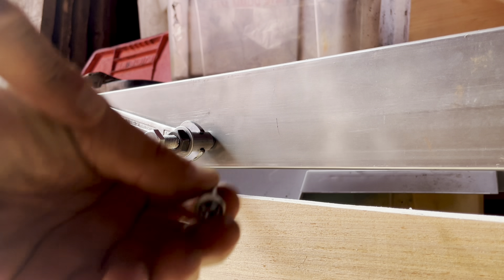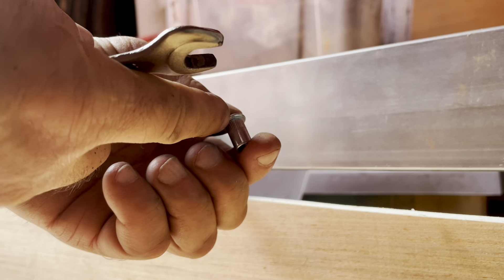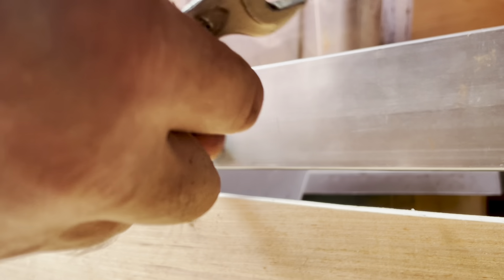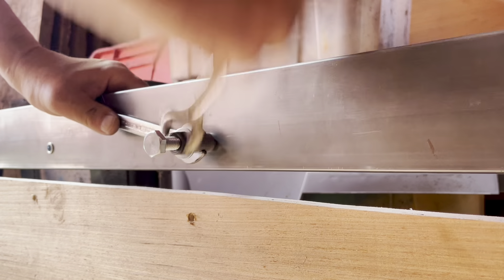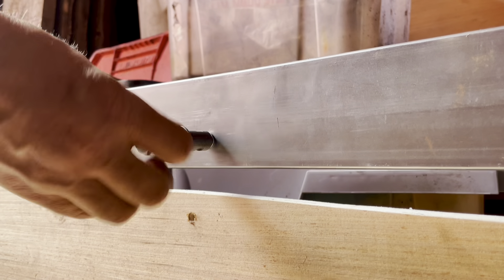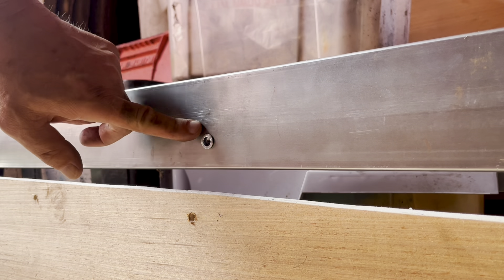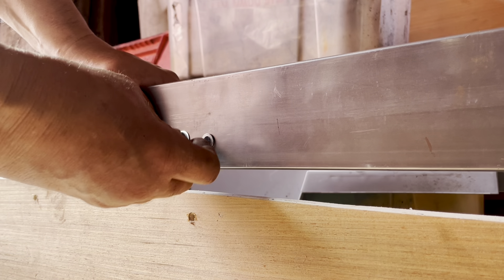You can see it's completely collapsed — this threaded portion has collapsed back onto the collar here, and where it's serrated is gripping on the skin. They're designed to collapse in and grip. So now we've got a thread in a 1.6mm thick steel frame.